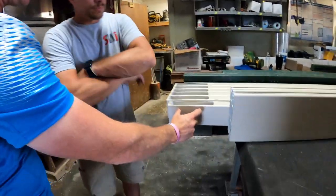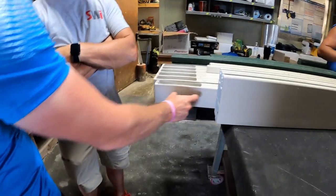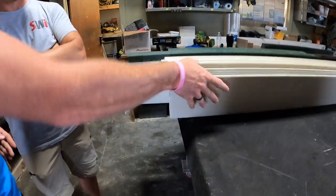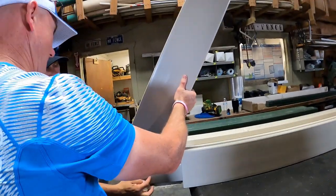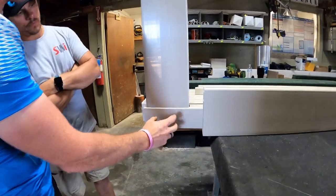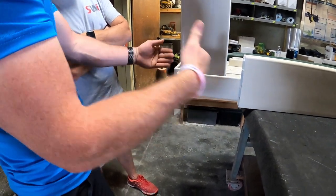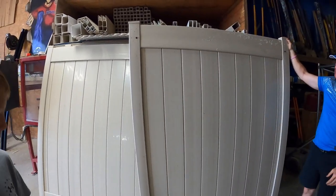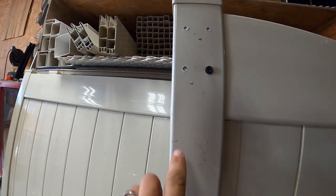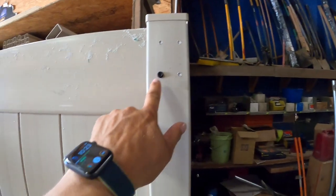What's very important is the crews put that hinge in exactly the right spot so the two screws bite through both rails. You can't put the hinge here. It has to go exactly there. They take that other screw out and put the hinge on. That hinge has to go where the aluminum overlaps. He'll have it set so the guys in the field cannot mess it up. Here's the gates, and here's how he's got the screws. It's the same screw on each corner: the bottom inside on every single corner, and the top inside.